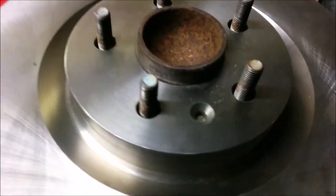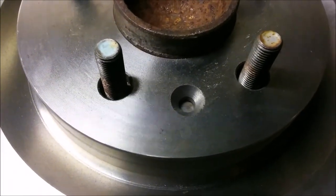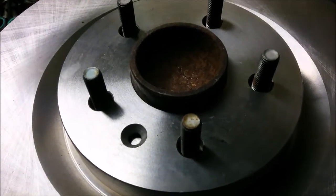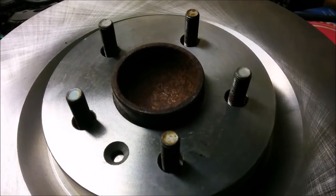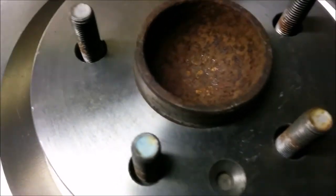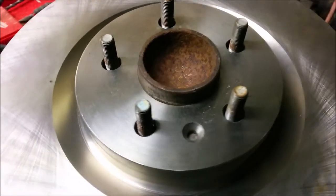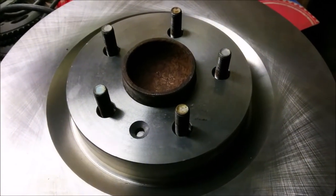We've got the hub fitting in now, but it looks like it's in there tight — I don't think it actually is. We're going to have to open up the inside of the bevel, just like I did on the other one. I'll take the base off the trim router and use it like a die grinder to roughly relieve that inner bevel until the hub fits all the way on. At least the bore is done — and you can see when it focuses that it's a really good cut, perfectly circular. I couldn't be happier with this solution. I'll turn the speed up to about three for the bevel work.